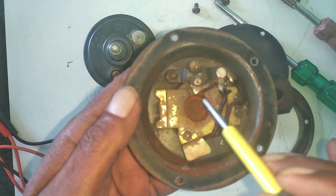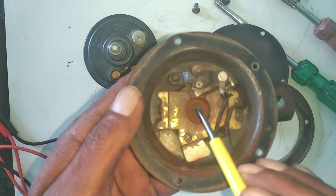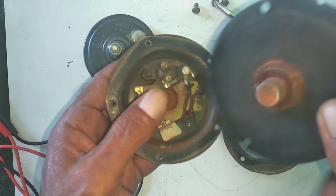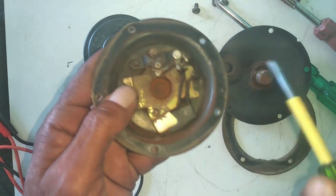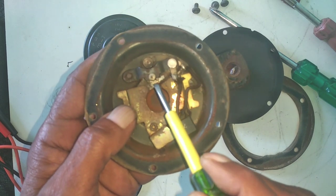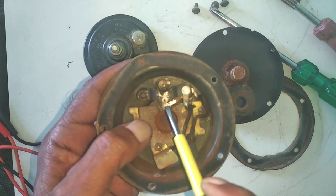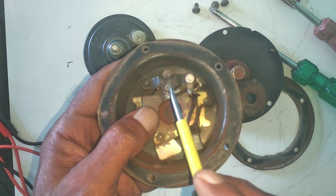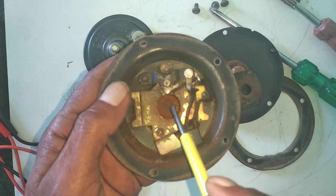Because the current will not get supply from here — it will be cut. The plunger disconnects. When the current is cut, the circuit opens again, the current will come again, and then the plunger will be pulled down again. This oscillation cycle continues to produce the vibration.